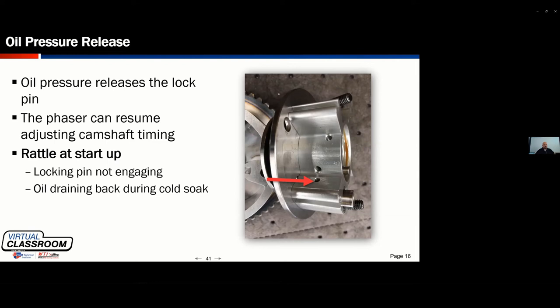Because if you've got stuff in that oil passage that's waiting for the new solenoid or new actuator you're putting in, it doesn't matter what level of tech you're at — if that stuff's in there, it's not your problem then. But if you don't bring it to somebody's attention, you're going to marry that thing. So just due diligence in repairing these — be real careful and watch out for that stuff when you take them apart in order to make sure you're not marrying that car.